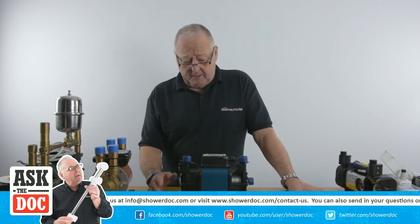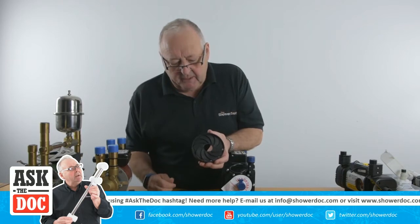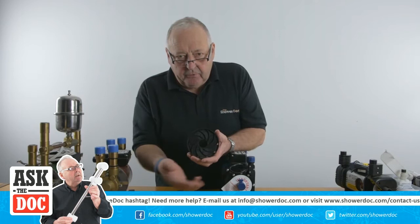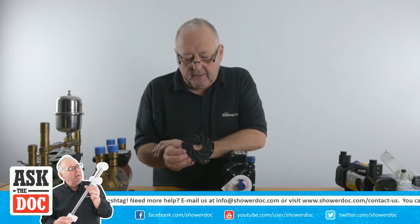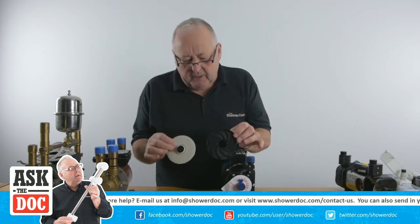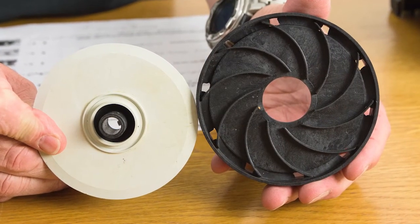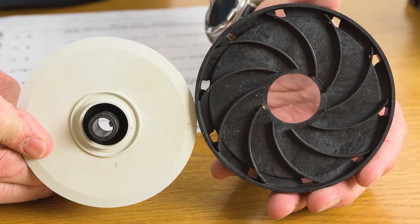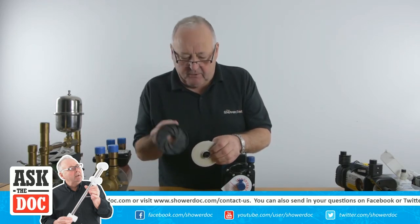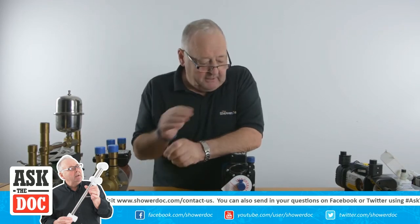Although if there's air getting into the system, centrifugal pumps are much more sensitive to a bit of abuse. What happens inside the impeller as it goes spinning round is it grabs the water and throws it to the outside — it's a much, much quieter way to use the pump. As you can see, the bits fit together like this, and you can have multiple elements on these, throwing the water further and further to get more and more pressure. Effectively, the water goes in the middle and because of these vanes inside, it gets thrown to the outside edge, and that's what creates the pressure in this type of pump.